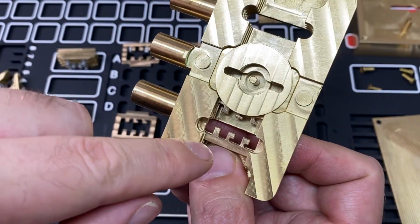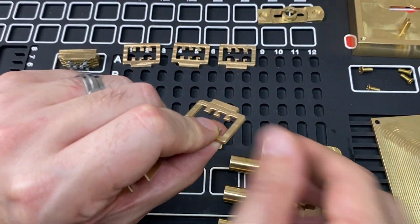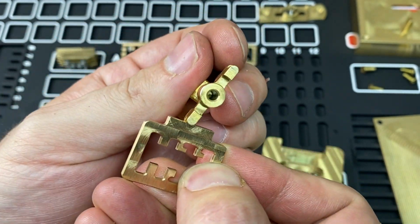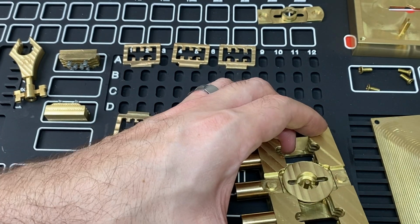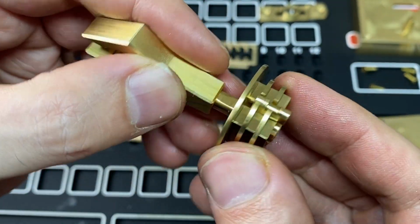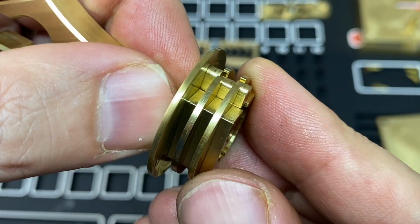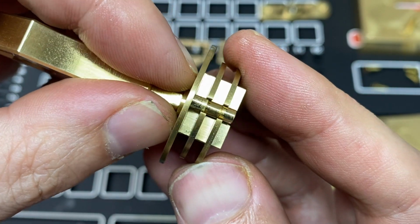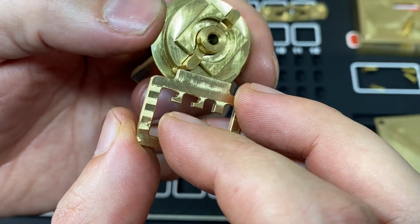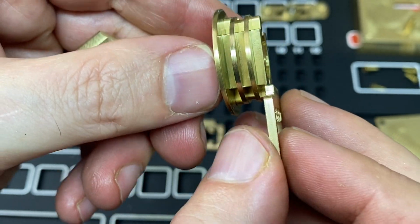So when I first saw this lock, my first instinct was that the key itself must interact with the bellies of the wafers. So what I'm talking about is this part here, that key must interact somehow with the bottom of this wafer to lift it up. So it'll be here, then it'll be lifted like that by the key. And when I looked at the keyway, I thought, well, maybe I'm wrong, because it looks like it's sort of blocked off top and bottom. Then I thought, actually, no, of course, you put the key in and then turn it. And you can see here that in the keyway, you are exposing both sides of the bitting of the key in those 3 grooves, which obviously relates to where you'd interact with the wafers themselves. So yes, you do actually interact with the wafers by lifting up the wafers to a particular height, depending on the cut of the key here.